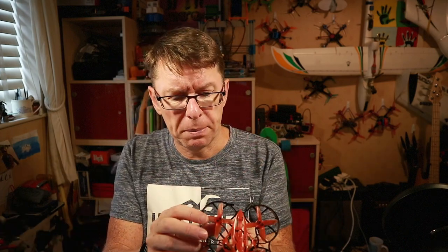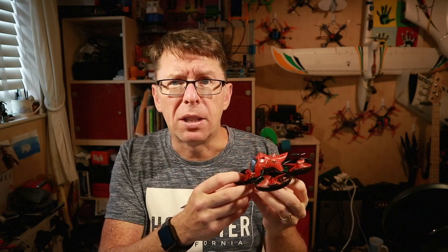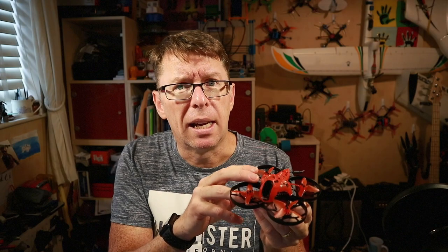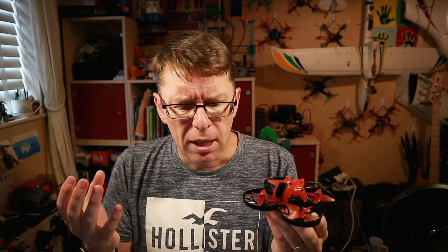So let's go through what the spec is here. It's a normal 85mm sort of Whoop style quad, although obviously a lot heavier so it's a Cine Whoop style. These are 1103 7000kV motors. The flight controller I must mention because it is the CrazyBee F4 board, and every time I review a quad with one of these boards - and I've reviewed a lot of them - I get a lot of comments saying 'wouldn't touch that with a barge pole, CrazyBee boards keep exploding.' Now this might be true for other people but so far I've had like nine or ten quads that use these, I fly them pretty hard, and I've yet to have a failure.